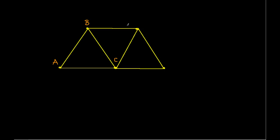Here is the free body diagram of the whole truss. We have joints everywhere the members meet. On the left we have a pin joint, so basically our entire truss is free to rotate. This gives us an FAX and an FAY. Here we have an FEY, and at the center of the truss we have a one kilonewton load.